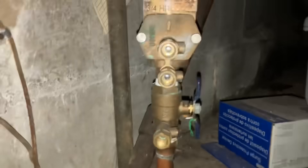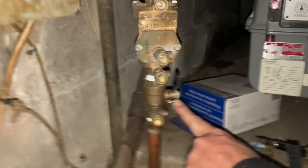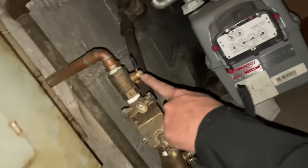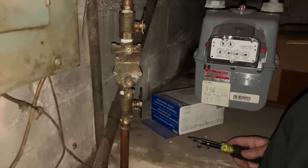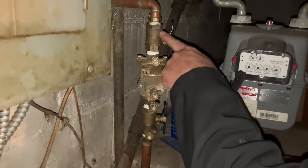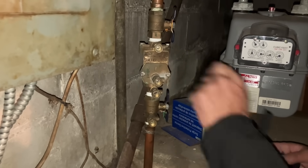What does this valve represent? What is this one called? Shut off valve number one, shut off valve number two — and that's because the direction of flow is from the bottom up. If it was reversed, this would be shut off valve number one and that would be shut off valve number two. This is test port number one, two, three, and four.